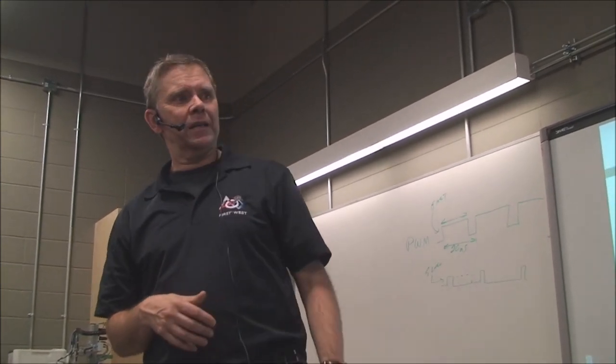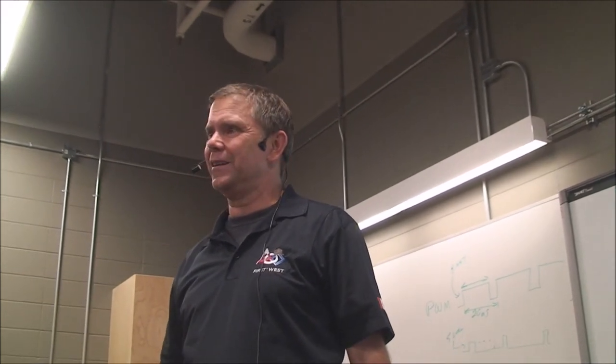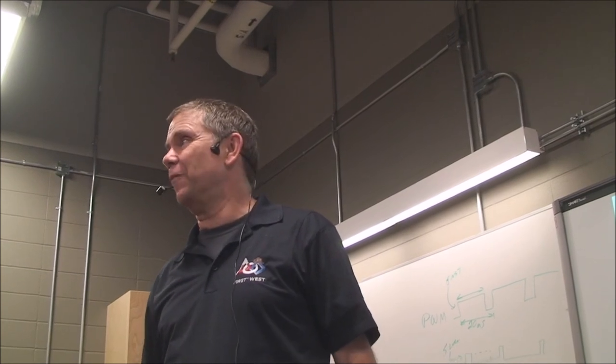Anyways, that's sort of the once around for the electrical control system on the FRC kit. And it's pretty straightforward. If you wire it neatly, it's not too hard to tell if you made any mistakes. It's also pretty forgiving. You can make a few accidents in there. I don't encourage you to reverse polarities here and there. And more often than not, they're protected inside, so they won't burn out. I'm not condoning that, but I think it's nice to know that if you do make a small mistake, you've got at least one level of coverage, right?